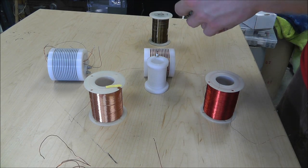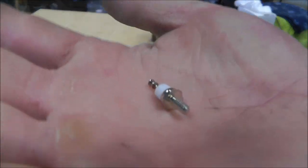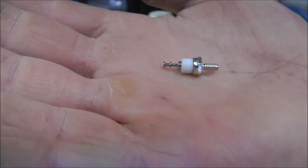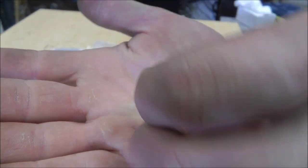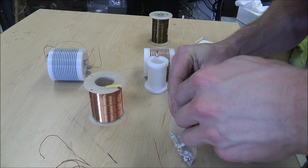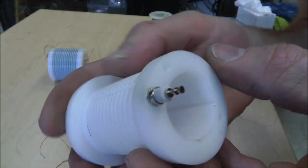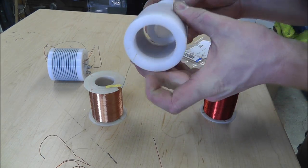The second thing is connectors. These are the connectors that Firepinto found, and they look just like this. Now if you look at Stan's photographs, the only difference is that this has an extra little spacer in it — I'm almost wondering if that was cut off in those pictures, because we couldn't find those exact ones. But these are otherwise identical. The thread is even correct — it's a 4-40 thread. The only other difference was that these were too long, so I used my snips and snipped them off. It fits on there just right, slides through without hitting anything.